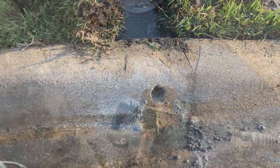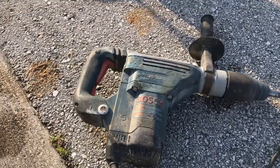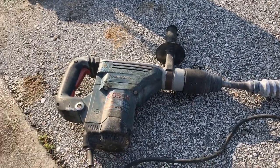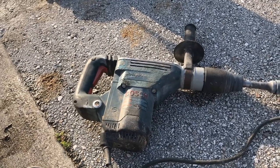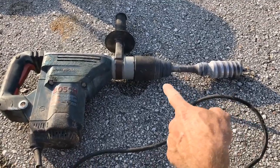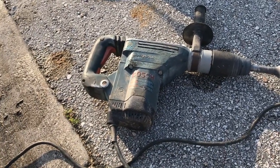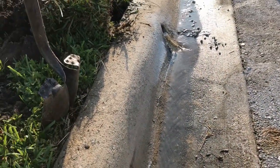We just need to tunnel the sidewalk — we'll probably have to shut that pump off because you can see how much water is already under the walkway, but once we get that done, this will all be cleaned up and ready to go. If you're going to buy a hammer drill, remember these are available for rental — around 60 to 70 dollars for the day. This is a Bosch hammer drill I've had for about seven years; it's been beaten up but still works great. This is an inch-and-nine-sixteenths shank — that refers to the bit size that goes into the machine. You really need one of these if you're going to do any type of concrete coring, bricks, solid concrete, or block.